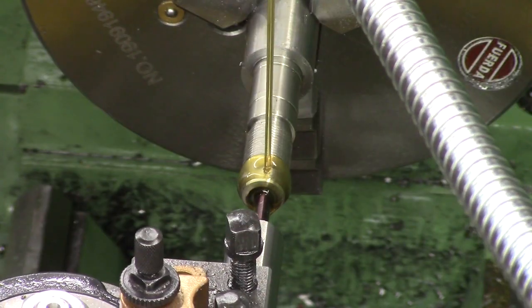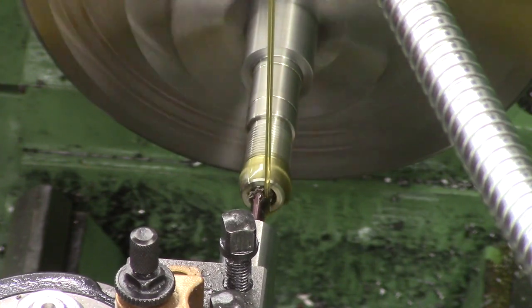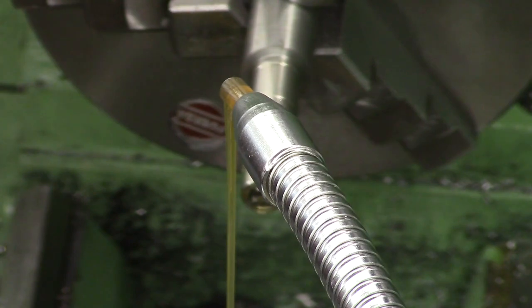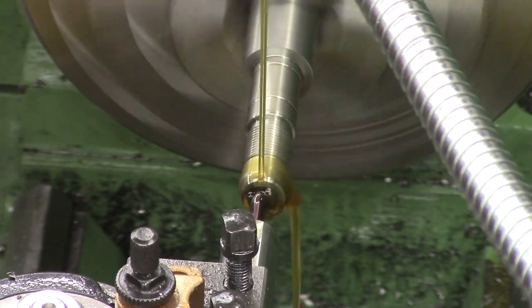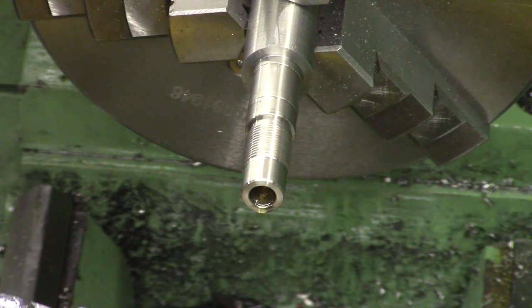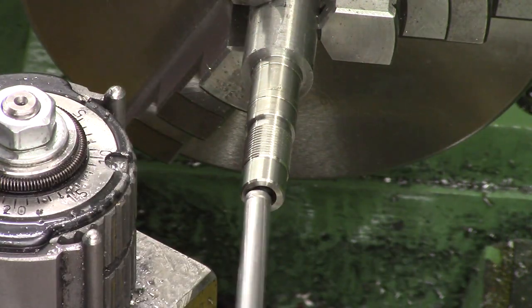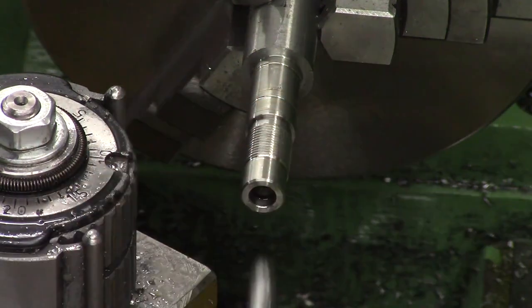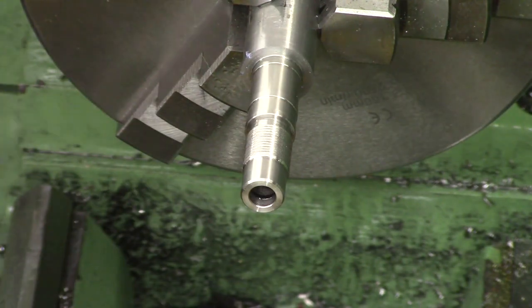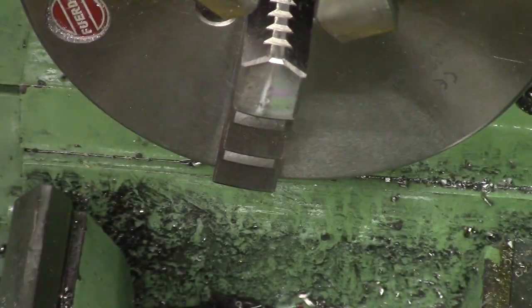Lastly in this operation we cut the o-ring groove. For this part I made the o-ring groove a little bigger — I'm not sure if you could do it for any calibre other than the 177, but normally it's a 7x1 o-ring that goes in the end there. I changed it to a 7x1.5, and also made it a bit tighter than the original. For some reason the 177 liners look quite loose in the steel parts, so I increased the squeeze on the o-ring and made the liner a better fit so it's nice and tight. Then I used a drill bit to remove the burrs kicked up by the o-ring grooving tool and gave everything a good clean. I test-fitted an o-ring just to make sure the liner went in smoothly, then removed the joiner from the mandrel using some brass to protect the surface, turned it around and deburred it.